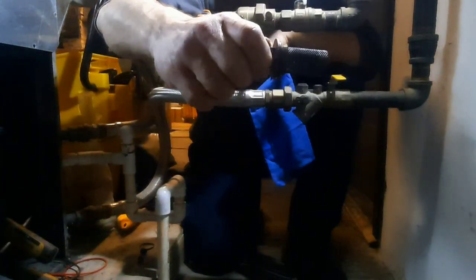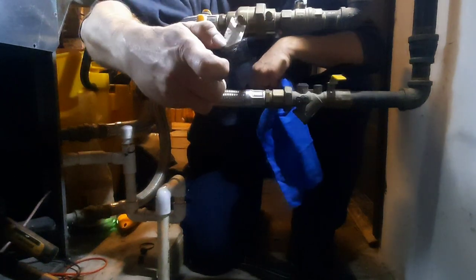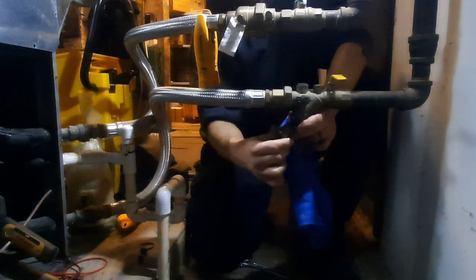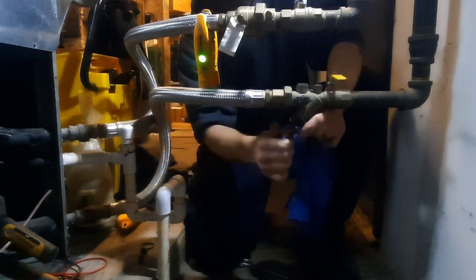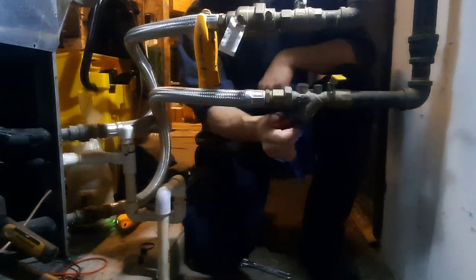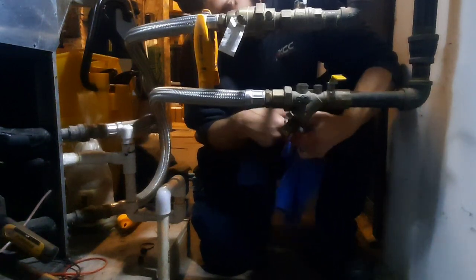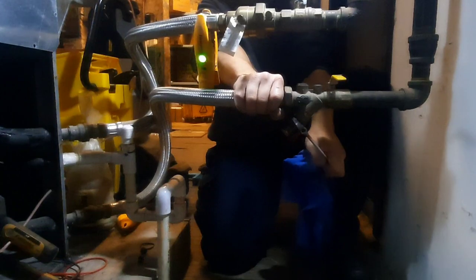So I got the strainer clean. Usually you get what feels like calcium buildup and rocks basically, but this was like a gummy, sticky, oily type crap in there. Hopefully our strainer caught everything. Just like an airflow issue — in a straight cooling unit you'll have that low suction pressure. But it was awfully low; we might be low on charge. This unit only holds 72 ounces, I believe — so a couple pounds. We'll get our strainer back in, turn it back on, let it time out, see what happens.